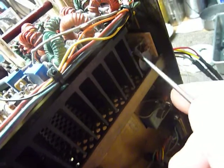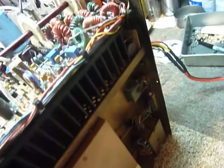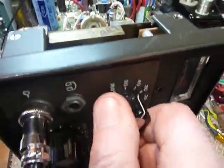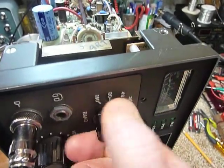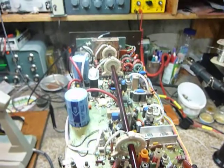On the external ALC board there's a little yellow wire that plugs in right here. You've got to be real careful not to forget that. If you leave that wire off you won't get any output. I messed around for a couple of hours trying to find out why I didn't have any output — it was that yellow wire.